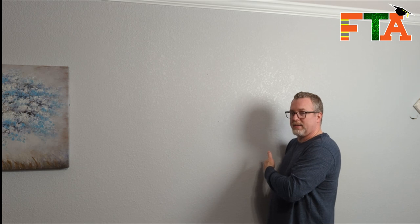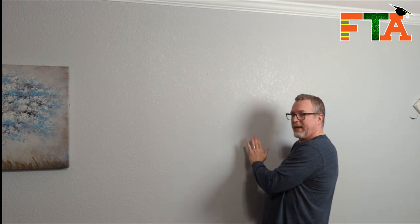If you have a standard wall plate that has hooks on it, then that's not such a big deal because you can center that. And most of the ones that have just two arms for brackets, there's movement where you can slide left and right. Whether or not we're going to mount into studs, we want to know where the studs are.